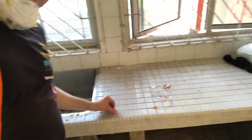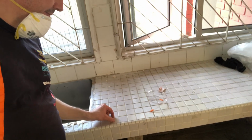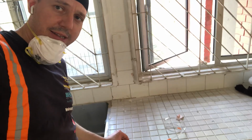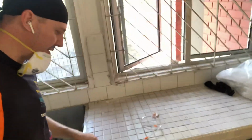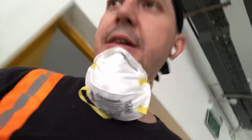You need to come in a bit, because when you put the tiles on, you're going to have a spillover. You're going to have a bit of additional space so that you can actually put the tile fix. So I've measured 57, so I've got this much more for the tiles and for the actual cement. And then you measure it out on here, which I've done.